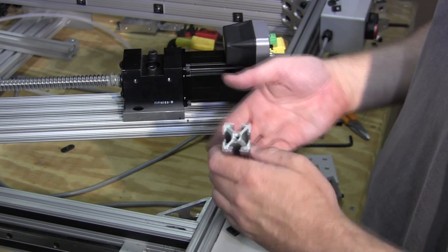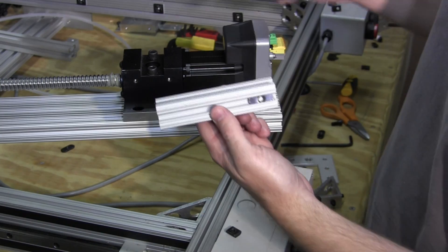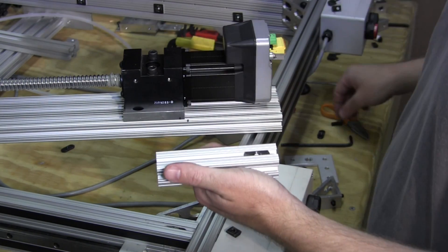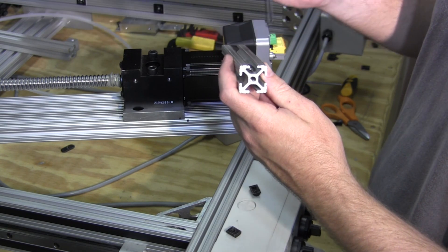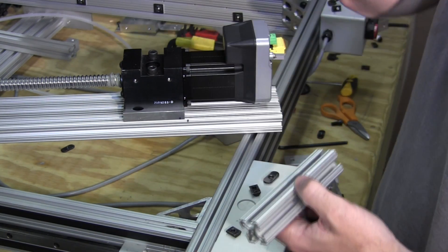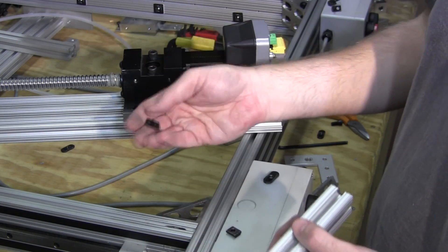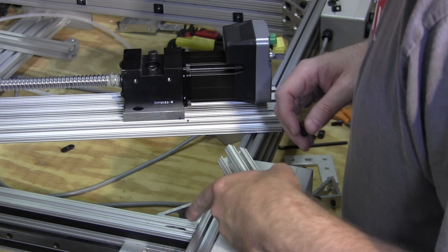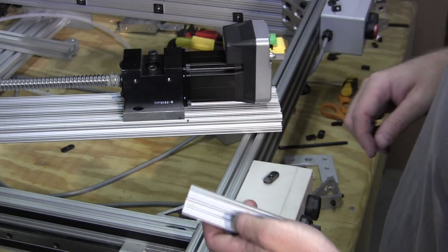If you've got something you've got to take apart a lot, there's not much that's more frustrating than putting a t-nut in there on its side. If you're doing something on the inside of the rail and trying to get those threads to mesh shooting a screw in from the side - sometimes even up and down is a problem because the bottom of the track is concave and the t-nut wants to sit on one side or the other, getting cockeyed. If I had known what I know now, I would have used the ones with the set screws - put them in one time and be done with it. But I've got some witness lines inside the track so I roughly know where they need to go.